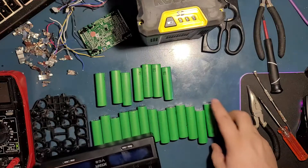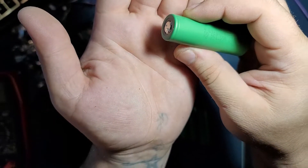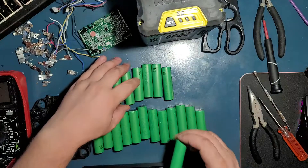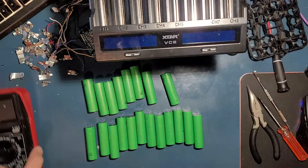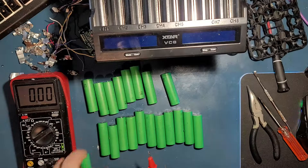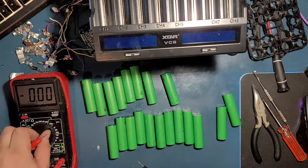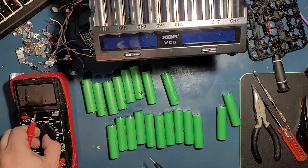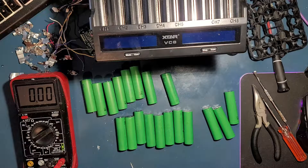After all that, I will have to file all the heads — you can see right here the remains from the spot welding that will have to be filed on both sides, all of them, to make them sharp. Then I'll throw them on my battery conditioner and charger and see where we go. Let's check one or two at random if they have any juice left. Zero — they might be dead, but I'll try to salvage as many as I can. Let me check if my meter is working — yeah it's working, so it's the batteries unfortunately. Let me try another one. I will have to throw them in the charger and take it from there.